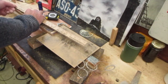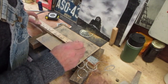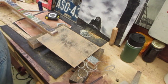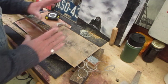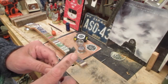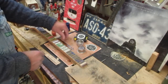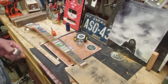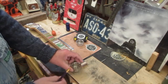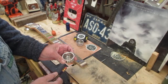Just a tad more and there we go. Now where is my scale going to line up? I put my scale up here at the nut end, hold it right there, and make a mark — that's where my floating bridge is going to be. So everything is going to line up. It's just a matter of getting the sound holes in and making sure everything lines up well. Remember, I told you a little bit earlier about this depth gauge and going around the edges to match the thickness of the side of the box.